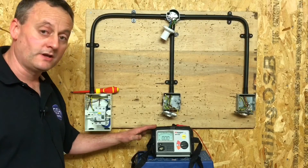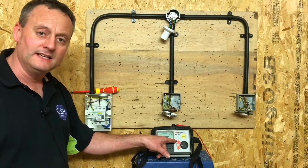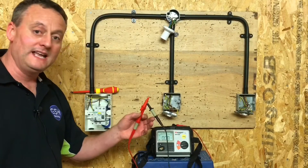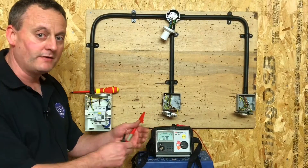We've set up our meter — it's just a slightly different ohmmeter and I thought I'd use this one. The orange scale is the ohms and the red scale is the mega ohms, and we'll do both tests in this video presentation. I've linked together my leads, I've removed the resistance of the leads by pressing the test button, and we're ready to perform the test. Linked in the consumer unit, instrument zeroed out — we're ready to do our continuity test.